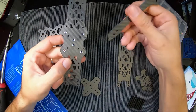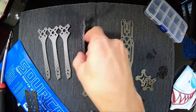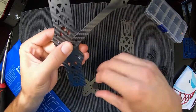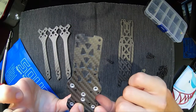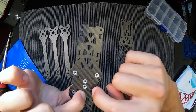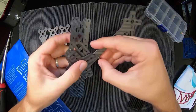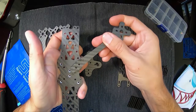Take your arms — they're all the same shape, so just make sure you flip them the right way. They need to go around that little hole in the middle. Start with one and grab one of your longer screws. Quickly, if you're building a 30x30 stack, go with the long screws through these holes here; if you're building a 20x20 stack, go through these ones. Put the arm on and then set the base plate on there as well.